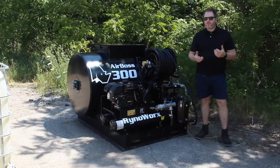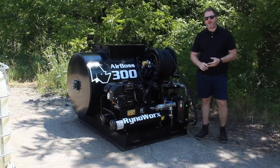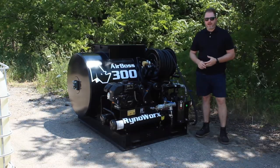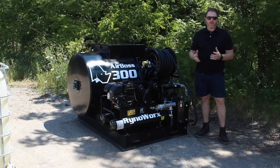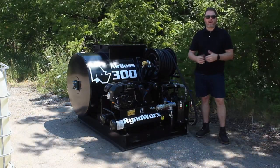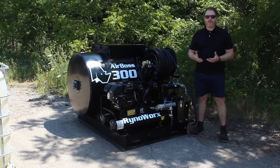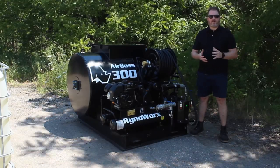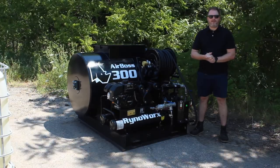Our pump is an aluminum dual diaphragm pump — a one-and-a-half inch pump with santoprene seals — and the unit operates with a range of 90 to 125 psi. We normally operate the pump at the lower end of the range; we find that with a two-gallon-per-minute tip at around 90 to 95 psi is the sweet spot for most types of sealcoat.